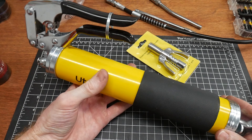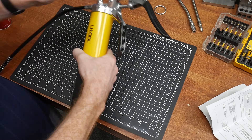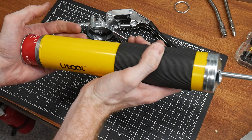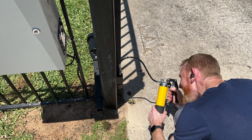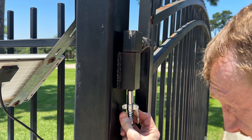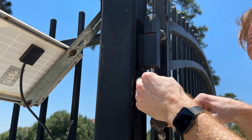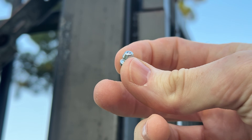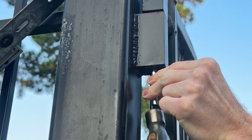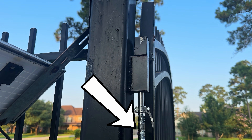Since I didn't know about an upcoming wrinkle at the time, I started working on other components of the gate. I got a new grease gun and greased the hinges using the most cost-efficient gun I could find along with some premium red grease. The bottom hinge greased up perfectly and I pumped it till clean grease came out the other side. The top hinge didn't work out that way — we actually popped the insert-style fitting out of the hinge. I tapped it back in, tried again with the same result, then ordered a pack of replacement fittings and reinstalled one using a socket as a driver. When I pressured up on the new one it didn't pop off, but grease started coming out of the threads of my grease gun fittings, so I decided to leave it alone — I'm guessing there's an obstruction in the hinge somewhere.